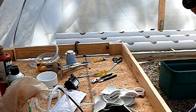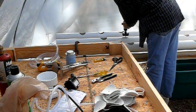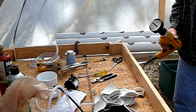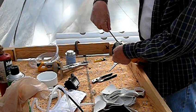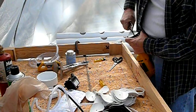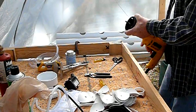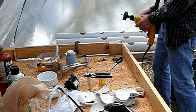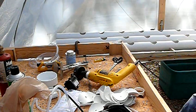I used a three-inch hole saw to cut this pipe with, and you'll see here it's pretty easy to do. The hardest thing is just getting this plastic out of here — get a pair of channel locks, and that's all there is to it. I went back in with a little grinding wheel to deburr this, and plan to use a yard blower to go ahead and clean this pipe out and get all the plastic shavings out of here.